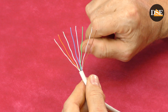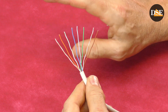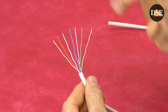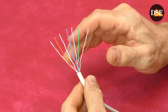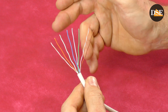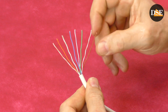In a CCTV system, we always make straight cables. A straight cable is a cable with the same color sequence on both ends. Which color sequence should we choose? It's exactly the same as I said, but the most popular sequence is sequence B. I don't know the reason why it is more popular, but that's the fact. So let's make sequence B.